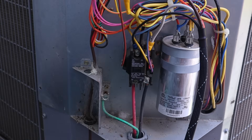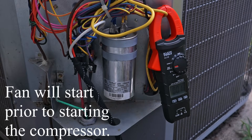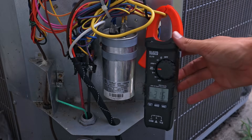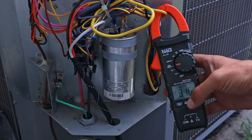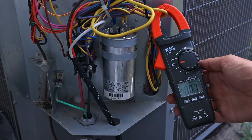Now that all the wires have been installed, we can test it out and start running the air conditioning unit. The soft start is going to need to go through a process of learning the system — I believe it's through five starts of the compressor. Let's start it up now. There's the fan kicking on, and the compressor kicked on — 31.6 amps. That is what we were looking for. It's getting about seven to eight amps running, so that improved a little bit as well.